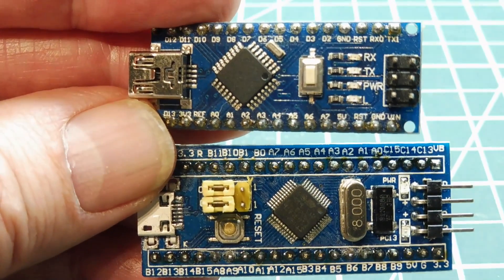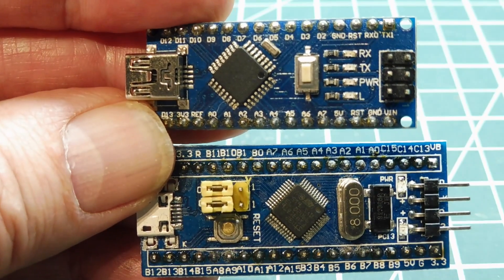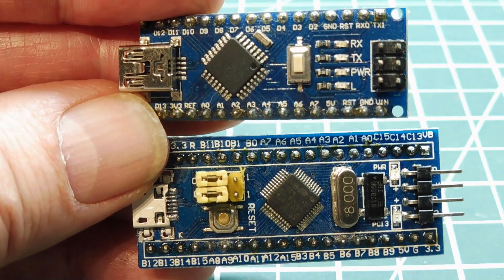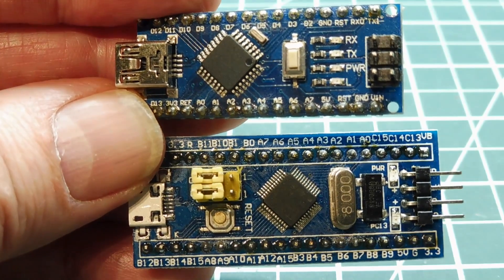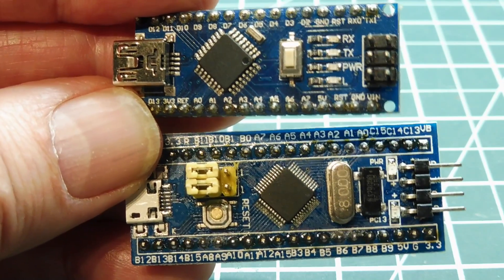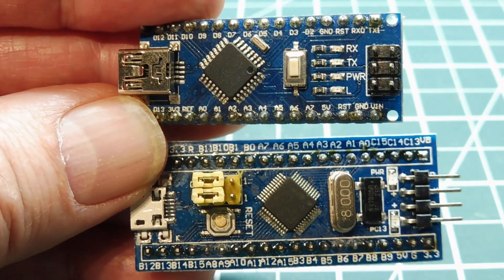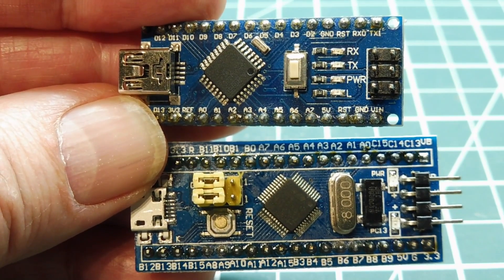In this video we are going to look at low power microcontrollers. If you're building a battery powered project you want your batteries to last as long as they possibly can, so you have to select low power components and the first component will be the microcontroller. The ARM microcontroller and the ATmega328P microcontroller, which is on Arduino Nano, have low power modes and you can put them in those modes to bring the power consumption down.